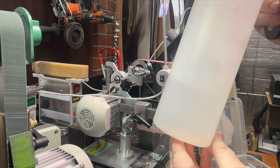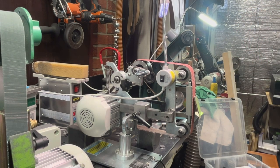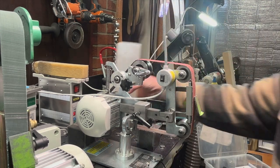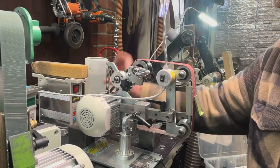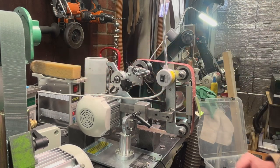Another good idea that I keep around up here is a little dunk tank to stick the knife in if you feel it starts to get too hot. The good thing with Cubitron belts and really aggressive belts, they tend to not overheat very much. So I've refilled my little tank because it was pretty low. I haven't had to reprofile anything in a little bit, but now it is proper. And I'm just going to grab my mask so that I don't have to have the downdraft table on annoying us, and we'll get started here.